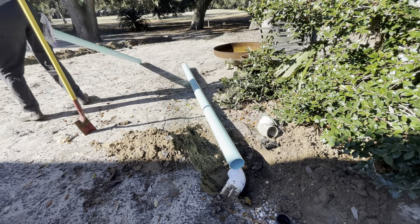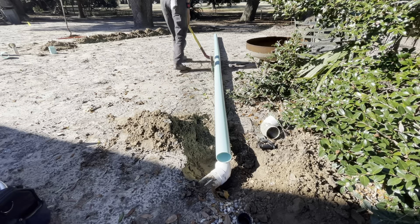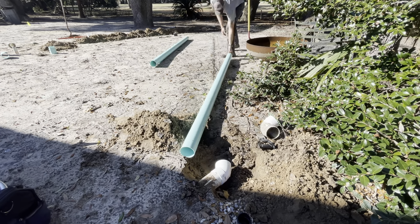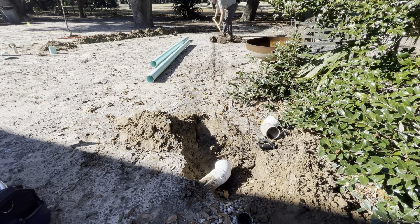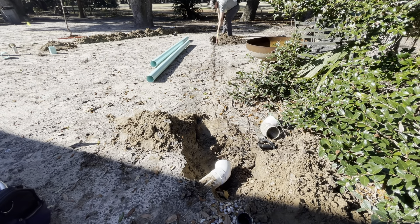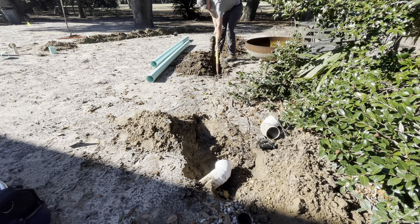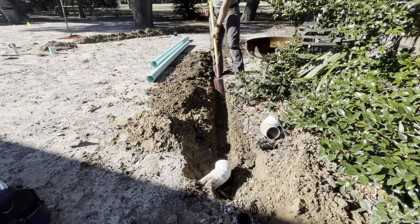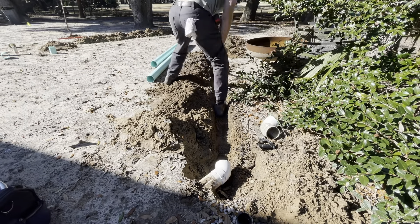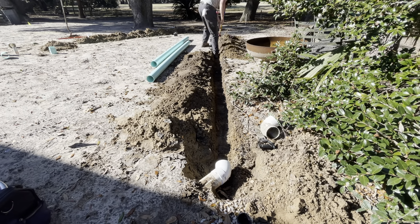This time I did it the right way. I set up my angle, my 45, got the first stick set up just perfect where I wanted it, and then traced it with the shovel. This trench turned out actually pretty close to perfect — I had to widen it in a couple of areas, but layout matters a lot with PVC. Whether you're using a trencher, hand digging, or an excavator, you want to have some paint, masonry line, or something that lets you know exactly where you're going off those angles, because it's just going to create a lot of extra work otherwise.